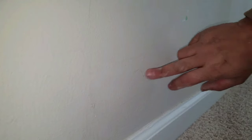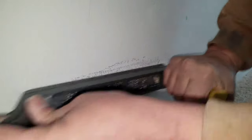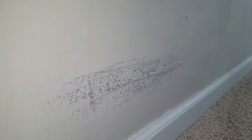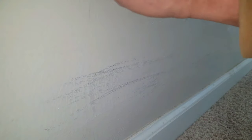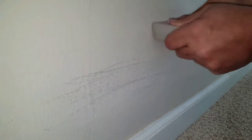As you can see right here, we have a pretty good sized drip. First thing you want to do is try to get this thing level. Take the RASP and work it down — you can feel it and see that the high spot is gone. Then take the sanding block and work that one too. There are quite a few spots — knock it down a little more. There's a little bit of a divot there, so I'm going to try to feather that.